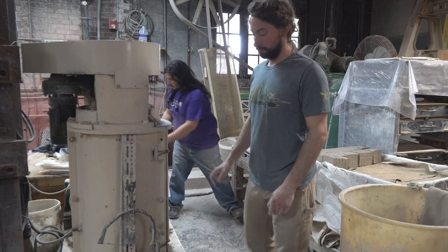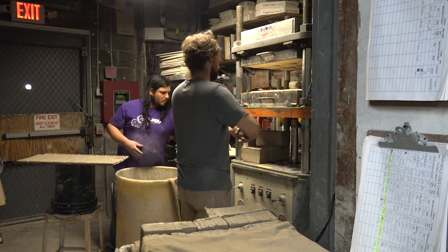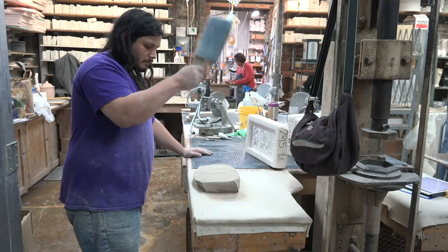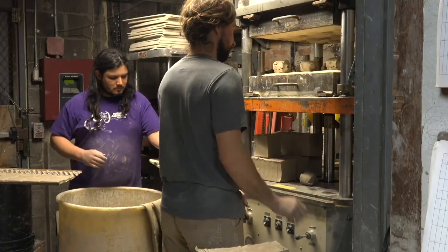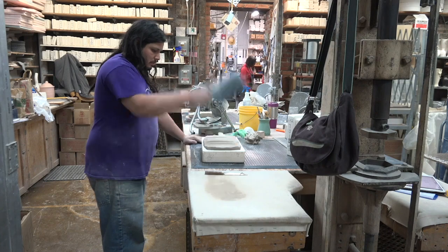The personal protective equipment includes floor mats. The workers observed were 5 feet 10 inches tall and 5 feet 6 inches tall. There are 3 types of tile pressing tasks: reclaim clay, which was not observed, prep clay, and press tile with the ram press, or hand press with the arbor press or mallet technique.